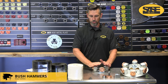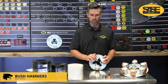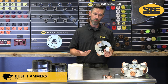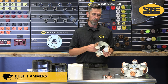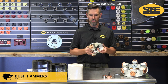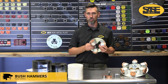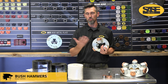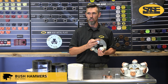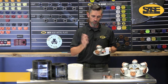Bush hammers are a really effective tool, however they're not the cheapest option. When trying to achieve a CSP of four to six, shot blasting and scarifiers are a bit cheaper. But if you don't own those machines and you already have a grinder on site for a smaller square footage job, this is ideal — no need for another machine. There are advantages too: bush hammers give you a monolithic profile, whereas shot blasters and scarifiers create overlap lines that can cause problems later if your coatings aren't thick enough. So there are pros and cons to keep in mind.